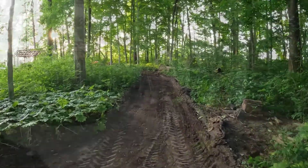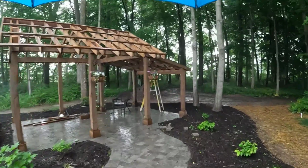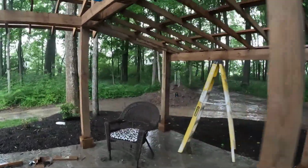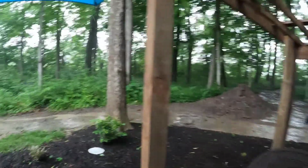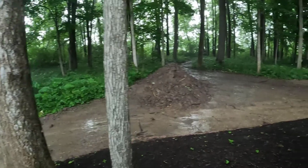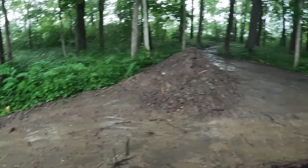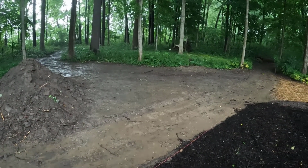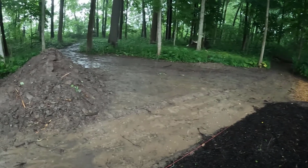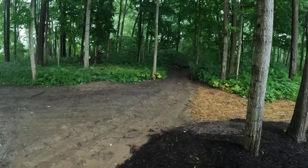Anyways, here it is. Looks really good. Okay, I'm risking it all to show you if this is working or not. Find out. Getting a pretty good rain right now. Let's just see how this swale looks like. It's probably gonna have some water in it. Let's just see what it's doing. Got some fall there. All right, here we go. You know, this will have grass on it, so that's gonna help it too. But you can see it's flowing. I see the bubbles traveling downstream. So I think with more rain, this is just gonna chew this out more and more.